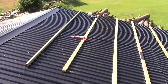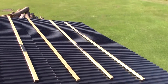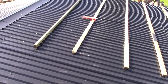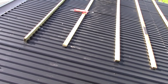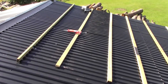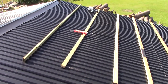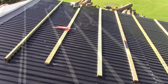And that's the first line. Now I have to continue with all the other lines as well. What I think about is that you should have roughly two supports underneath each solar panel, because they are quite sturdy and will be able to cope with the load. What's also important is that you have a height of between 40 and 80 millimeters from the roof to the solar panel. I'm sticking with roughly 60 in this case.